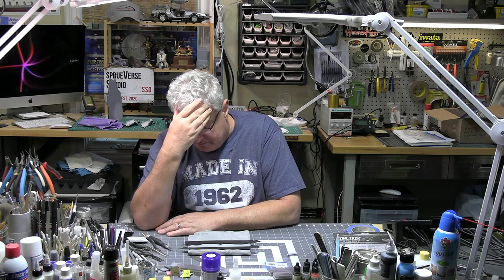So that's part three. In part four, we're going to take a look at the secondary hull and start to install some of that lighting. I'll also start to give the saucer a couple of, well, I will sand it to 1,000, 2,000, 3,000, and then I'm going to hit it with another coat of the next round of white primer and see what that looks like. Because the saucer then is basically ready to go, other than I've got to put in my rec deck and my VIP lounge, which I will glue in. But then I think we would be ready to seal that up.